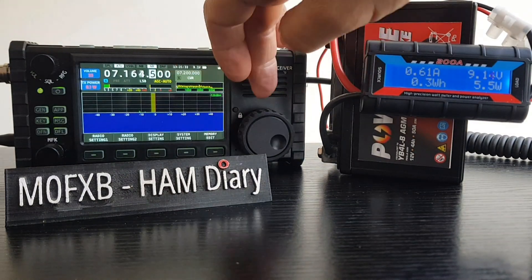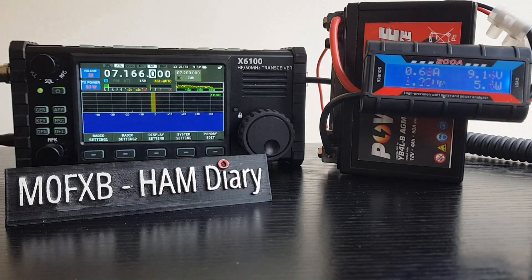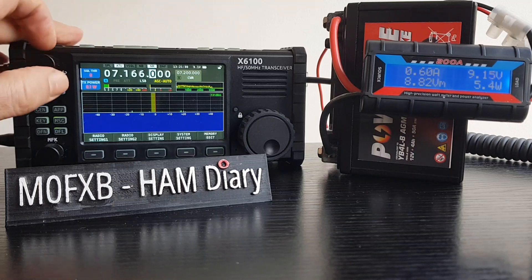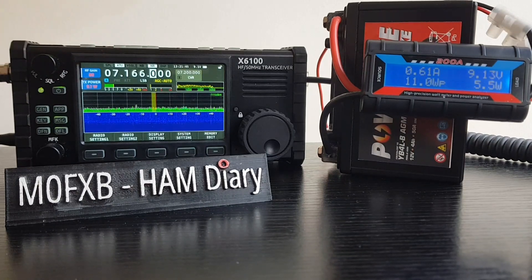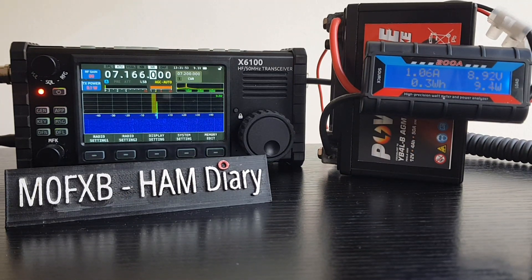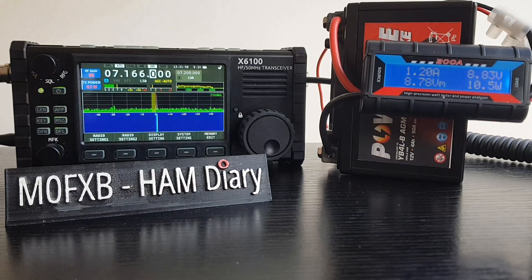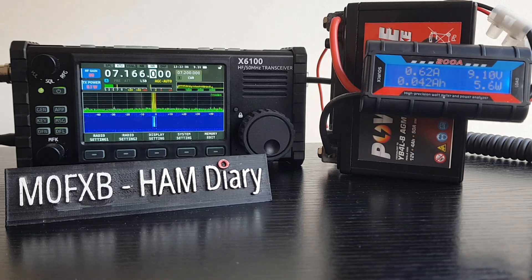Let's actually transmit now. We'll come off away from those people, keep it on low power. It is picking up quite a few stations out here on that whip - you can see them all in the peaks; get the RF gain right up so you can see them. At 0.1 watt, let's tune again then we'll whistle - same: 1.11 amps. So let's go to full power.